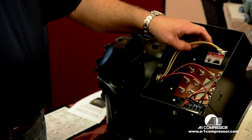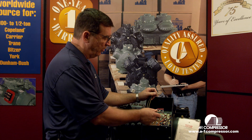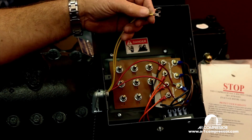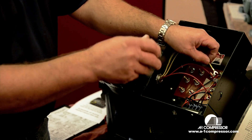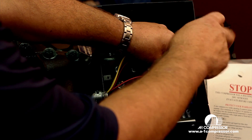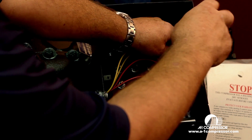That's your control circuit. We want it to be a constant power. If there's constant power here and everything's correct on all your sensors and your module is good, it will close your control circuit, which will finish the system and start the compressor up. Here we're going to install the control circuit wires, which would complete the circuit, allowing the contactor to pull in.